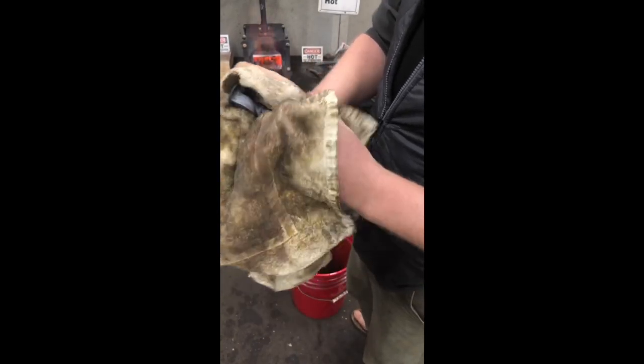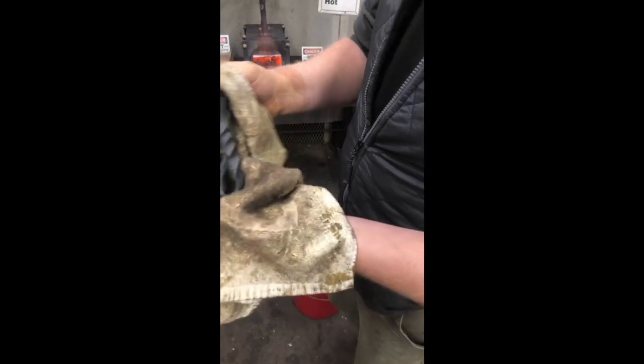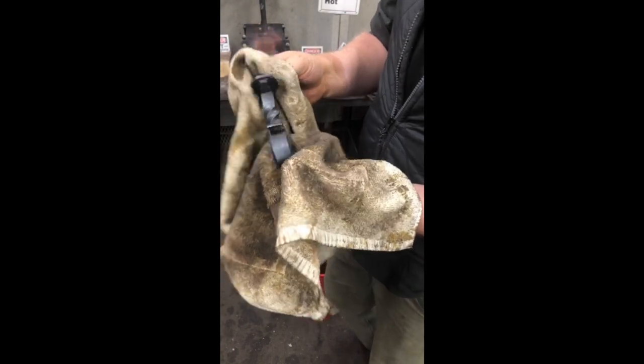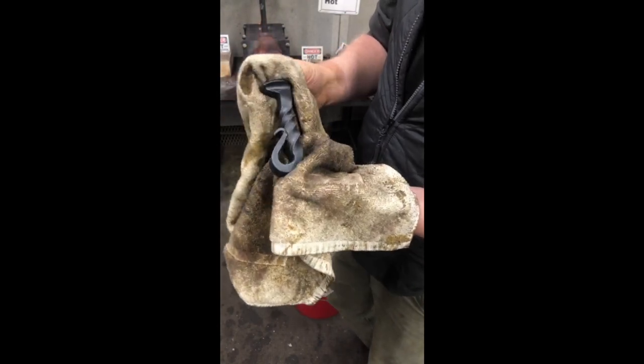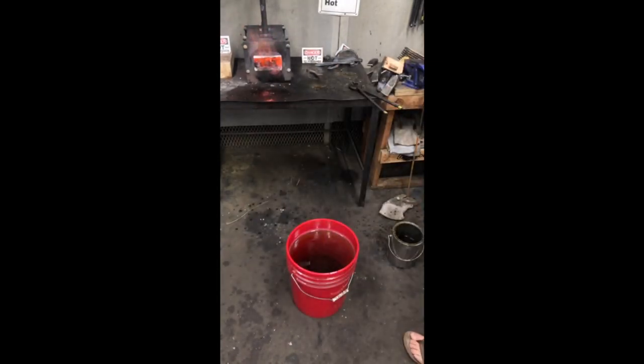This also makes for a nice water-resistant finish - it's not going to be waterproof, but basically what we're doing is the same way you'd season a cast iron skillet. We essentially opened the pores of the metal and allowed that oil to soak in, then it cools down and forms a nice even layer. And that's really how we do it - it's not that hard.